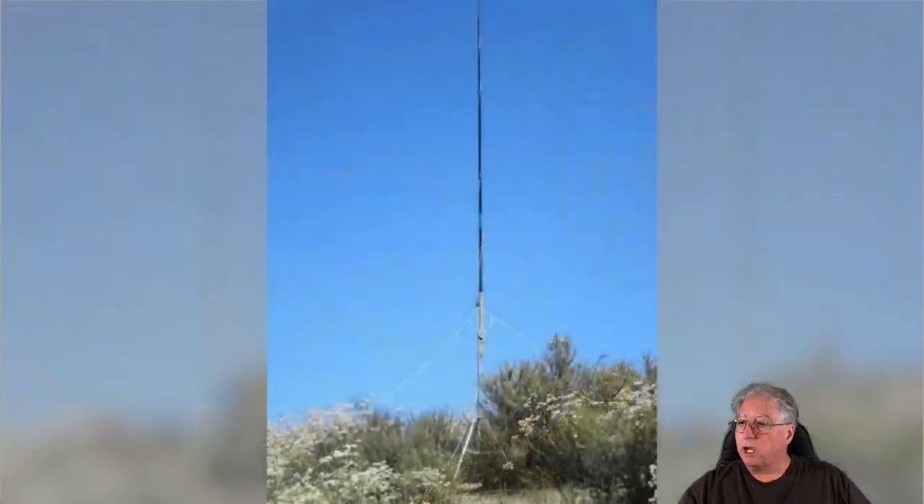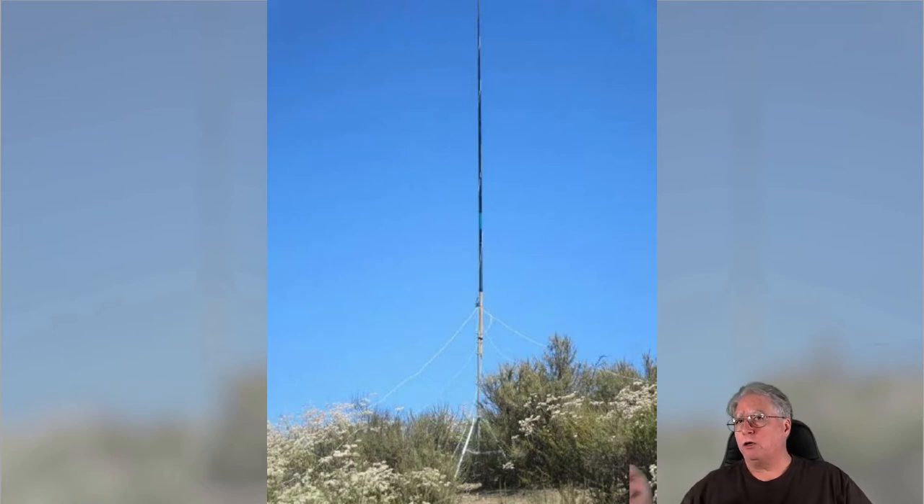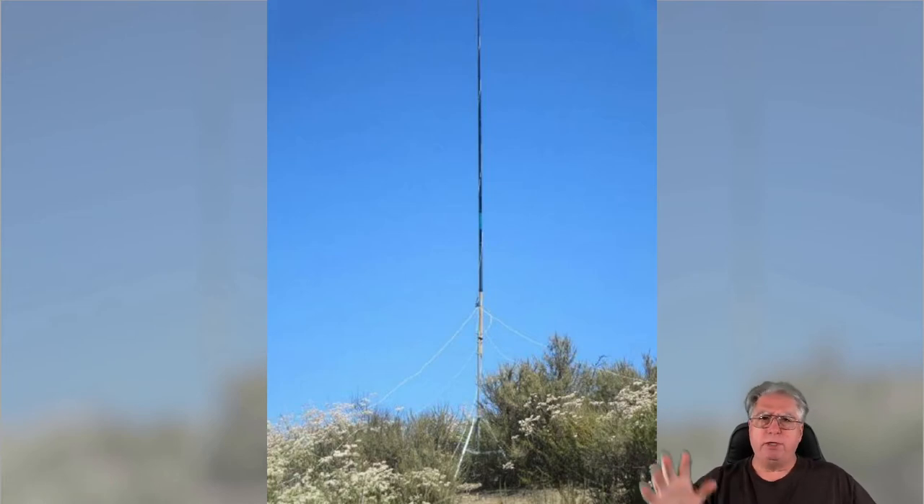Let's talk about easy, fast antennas, such as this HF Vertical. Easy to set up, inexpensive tripod, goes up low to the ground. If you can get on top of a hill, it's a really great antenna with a nice low takeoff angle. This is a single-band antenna — I believe it is a 20-meter. The CW guys for 20 meters at the Reagan Library for Field Day deployed this and had it up in 15 to 20 minutes.